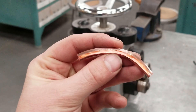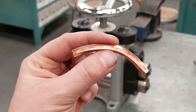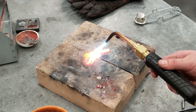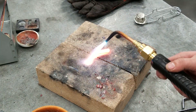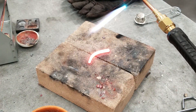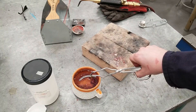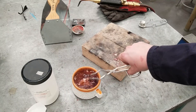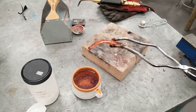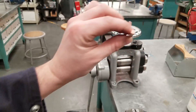If I go to try to straighten this up now by hammering or squishing it in a vise, instead of it looking like a noodle, I'm probably going to crack it right down the middle. So I want to soften it first. If I were to heat this up too directly, one part would almost not be able to handle it — it's like sticking something hot directly into something cold, it's going to make it brittle. So I heat it up slowly and let it cool for a moment before I dunk it back in the water. It's cool how as soon as you cool it off, that little surface scale from the heat kind of breaks itself off.